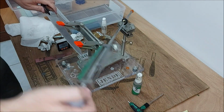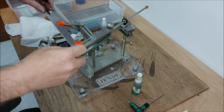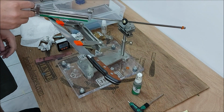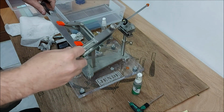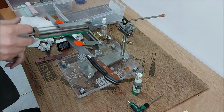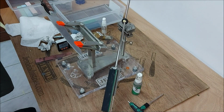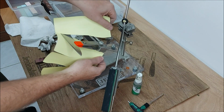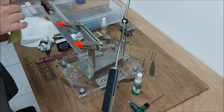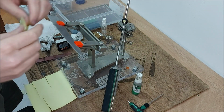On nanocloth you have a lot of dynamics, so you can tickle it, which is what I want to do right now, just tickle that edge. Or you can come in and really put pressure and get more aggressive. In this case, tickling is better. That should be enough right there. Again, you're just tweaking it. You're not trying to get a quarter micron finish on it per se. So we're back to where we started here, just about 5 strokes each side, and you should be able to hear that the crispness, the roughness, the toothiness is just reduced a little bit. It's a little bit smoother, but noticeably it's tangible when you're feeling it, the cut.